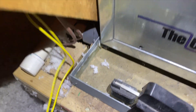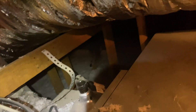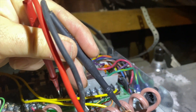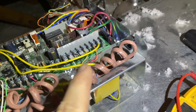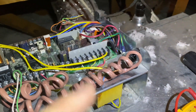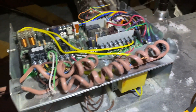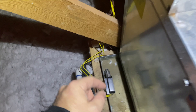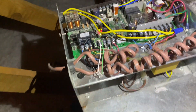Looks like it was tripped. Let's go ahead and try this again. Going between that yellow wire and common — if that was the problem we should be getting 24 volts, and we are getting voltage now. So the problem was we weren't getting a 24-volt signal. Even if the thermostat runs off batteries, it doesn't have 24 volts to send back to the board to do anything. Now I'm going to tighten that up so that doesn't happen again — it had tripped.